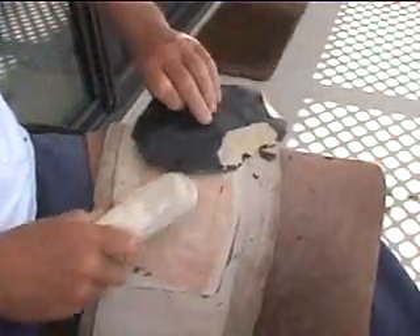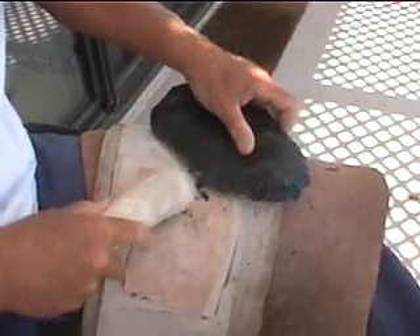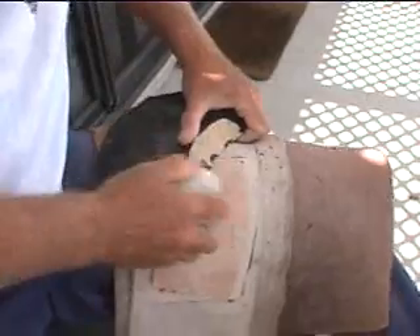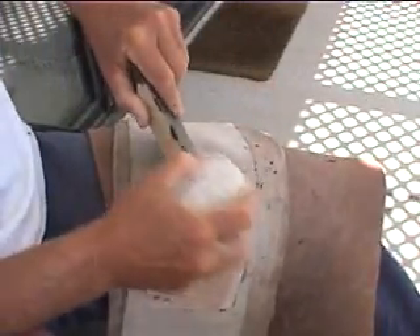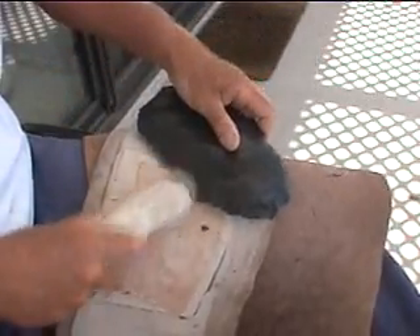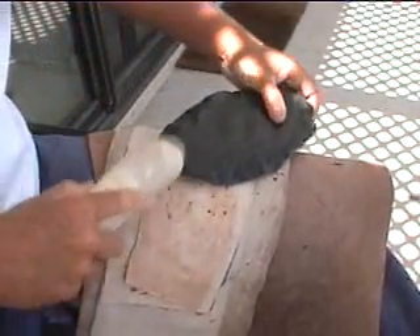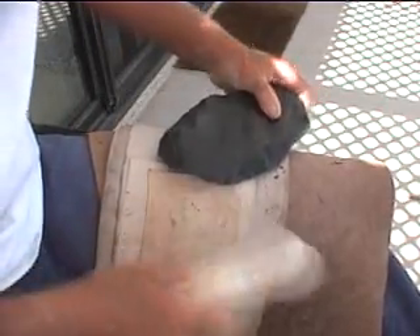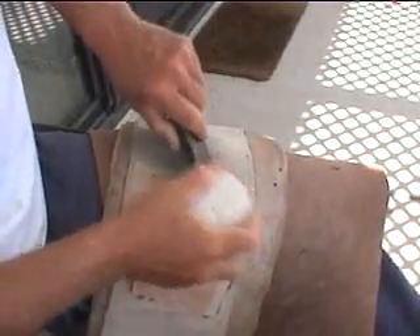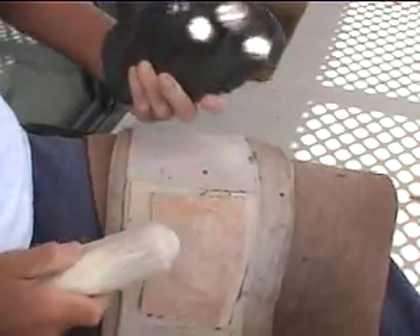You need to abrade these sharp edges here. Now comes a big one — sort of an isolated platform right there. Thicken that edge just a little bit, it's too thin. It's important to abrade it. Now kind of a snap. We've got some mass right in here — we'll set one up and drive one off over in this direction. Abrade it real well. If you don't abrade those edges, they're going to collapse. That's what allows you to do that.